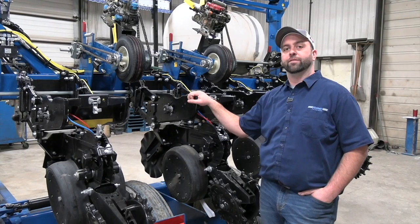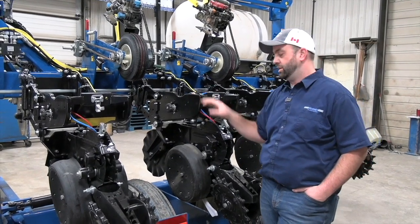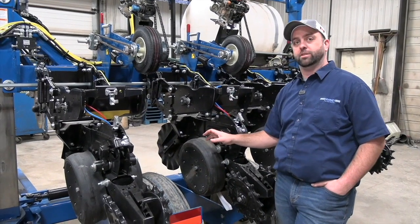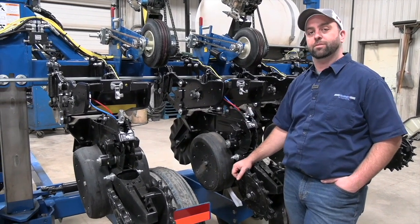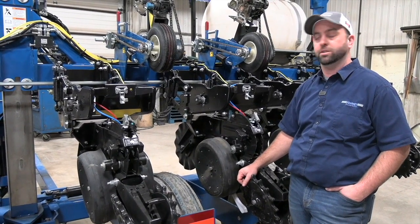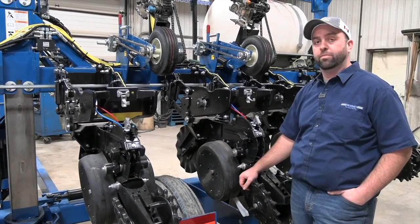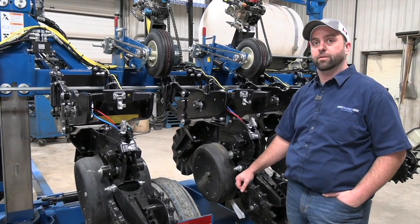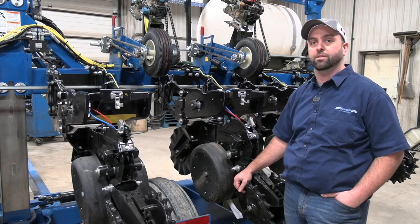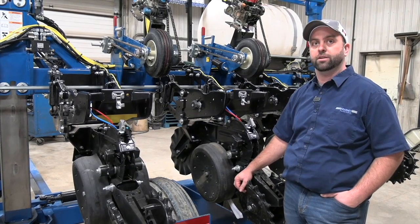Another point that I don't feel like maybe gets enough attention sometimes is tires and wheels. Inflation pressure especially, the maximum that's listed on the sidewall of the tire is never, if not very often, the right specification. Not only are they important for stabilization and for the wear life of the tire, but it's super important because the rolling radius of these tires is carefully calculated into the rate charts.